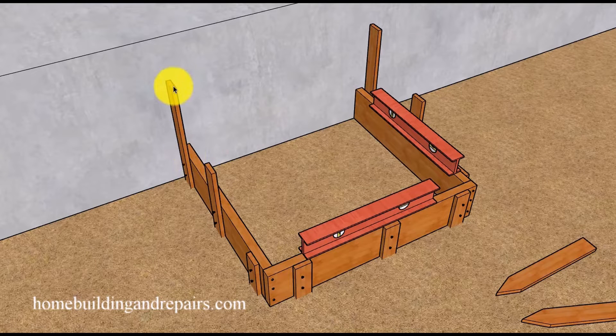Measure this before you drive the stakes into the ground. What I would do is start in the front, drive a couple of stakes, level it, and put one screw in each stake. Then use a framing square to make sure one side is square, drive a stake into the ground, level it, put one screw into the form board through the stake, then measure over and drive the next stake, screwing it in after leveling.